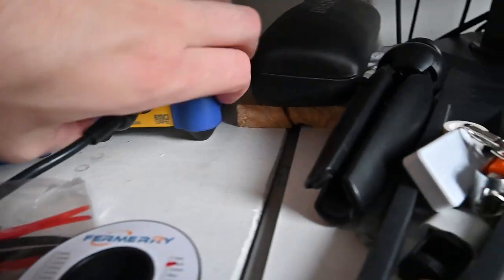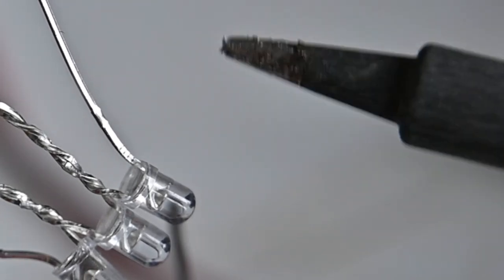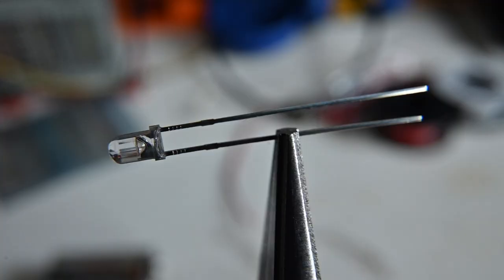There's a voltage drop of three volts across one LED, so three LEDs in series balances out to needing nine volts total to function. So let's start by making our triple LED sets. Start by plugging in and turning on your soldering iron — if it's the cheaper one, plugging it in is turning it on. Don't touch any of the metal from now on until it's cool. To check if it's hot enough, touch a bit of solder to the tip; it should melt almost instantly. Remember: do not breathe the smoke — work in a well-ventilated area. Also, do not solder on the dining room table — you will occasionally leave burn marks.